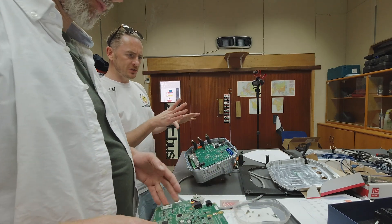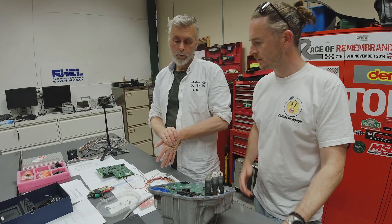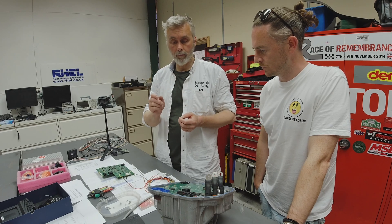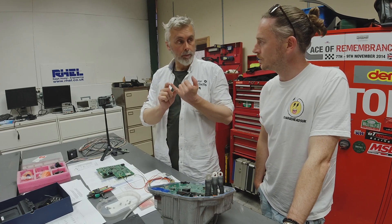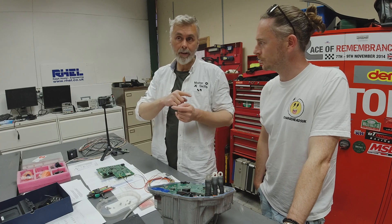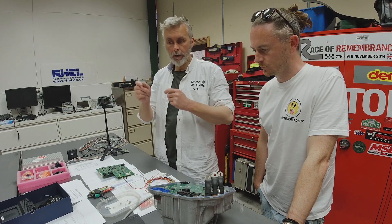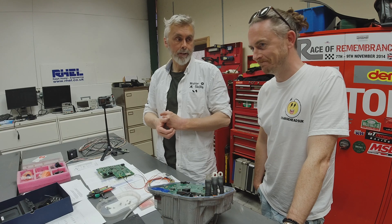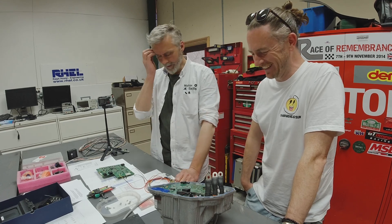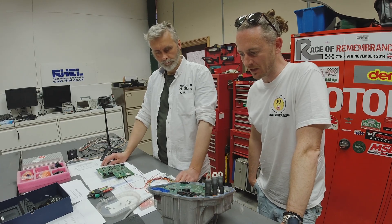There's also something to do with the twin-track pedals — it allows us to use one of those Tesla pedals. For OEM applications, we always have diagnostics on the pedal, so we're always checking it hasn't gone wrong. You never use just one accelerator pedal sensor — you always use two. We compare the two signals, the rate of change of those signals, and the maximum and minimum signals, so that if a wire falls off or chafes, there is no chance of unintended acceleration. Plenty of intended acceleration — but unintended, not so good.